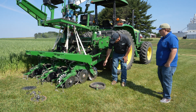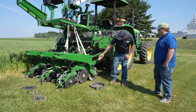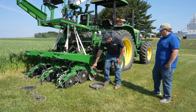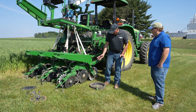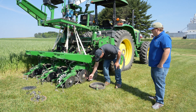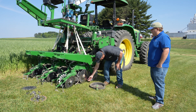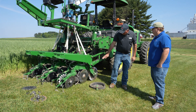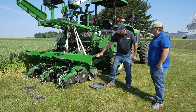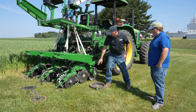In this particular planter, we want to check bearings and fasteners on the no-till coulter in the front, and make sure it's aligned with the planter opening disc behind it. Moving to the planter disc, we want to make sure the bearings are secure and in good shape, and follow the manufacturer's recommended clearances. On a double disc opener, there's a certain area where the two discs must be touching in front. We should also check the diameter of those opening discs — as the planter is used more and more, the disc diameter decreases and eventually they'll need to be changed.